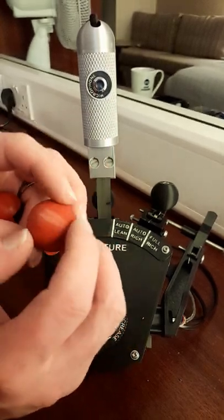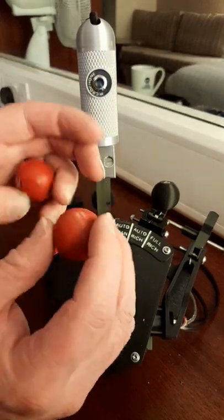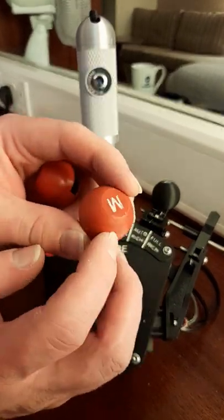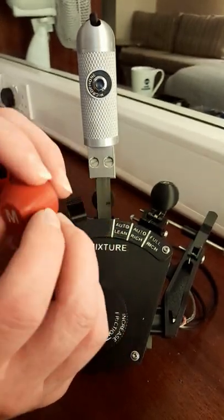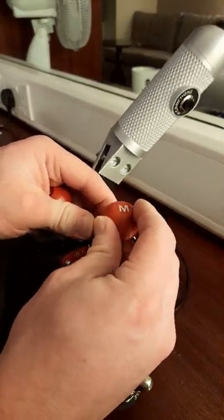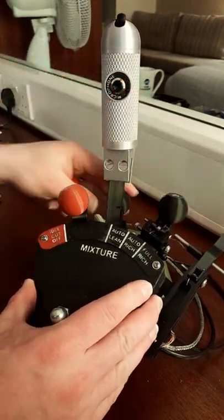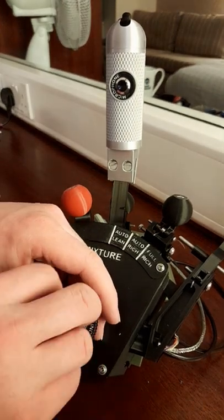If you've got some fine sandpaper and a bit of Brasso, you could probably polish this up to look quite good. I don't like the colour quite as much. I got a sort of burgundy PLA, and it was horrible to print. I had to turn the temperature right up and the bed temperature right up to get it to print. But it has printed fairly nice. You see, these just clip on, and they're on there, so all of that just clips together, doesn't need any glue.